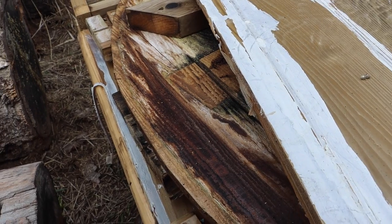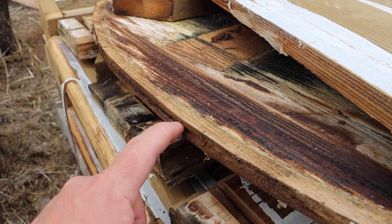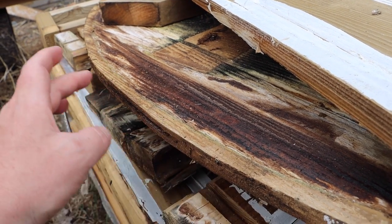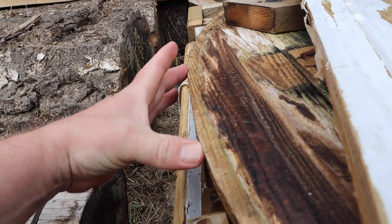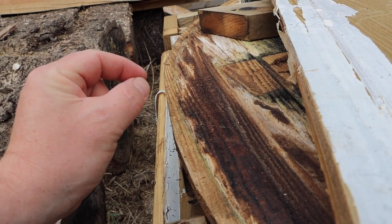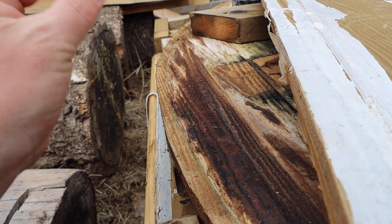Now for full disclosure on the true cost of ownership — there were two construction mistakes we made that, had we avoided them, this tub would still exist. We used a tongue and groove v-groove floor, and as you round the corner you can see the groove is still present. We must have been right on the limit of the floor width — the right thing would have been to shrink the tub slightly and get a perfect curve. Instead there was a flat spot of about six inches that wasn't making good contact with the stave, and that area was prone to leaking. We tolerated a small leak for about four years — it was so minor we just added a little water every day.